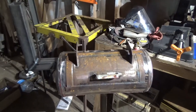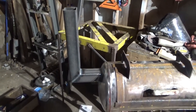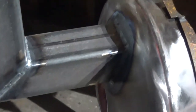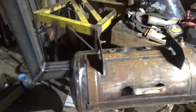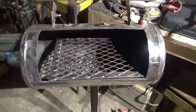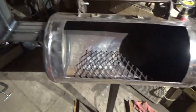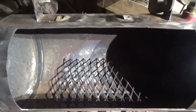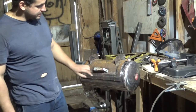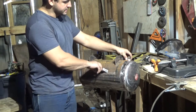Here's the almost finished product. I went ahead and done the stack out of 2x2 square tubing that I had, and just used my TIG welder to weld that on — came out alright, I think. Inside I have the grill I made, and a tray to get air underneath the fire. There's still a few little things I need to do, like cut off these little edges. I might put the thermometer in here if it doesn't hit it.